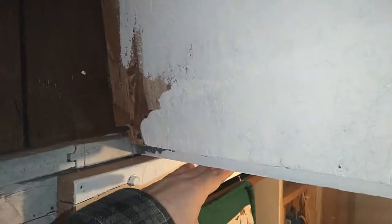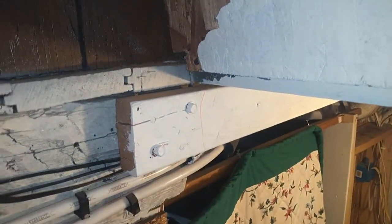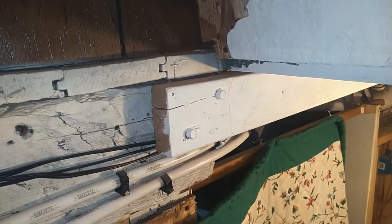And my thought was to come up here and take this piece out. However, behind this is some ductwork and other integral parts of the building. So we weren't able to remove this to give us a little more headroom, because that's another area that this stairwell does not meet building code. So international code requires, from this location, the bottom of the ceiling to the stairs down, 6 foot 8 inches, and we have right around 6 feet 2 inches there, which is considerably less than code. But we weren't able to tear this piece out because there are some structural elements behind it,